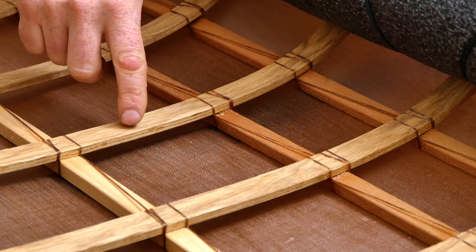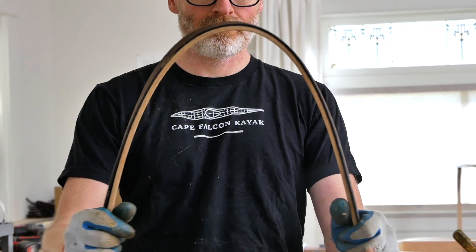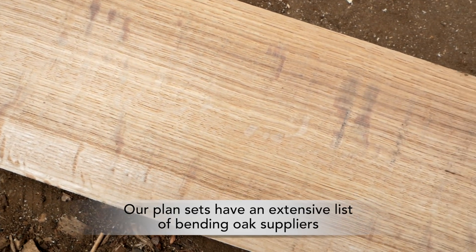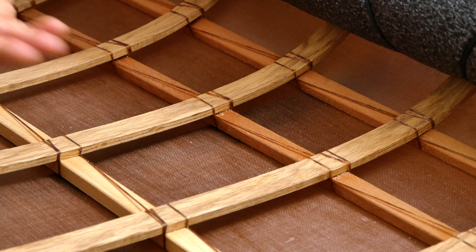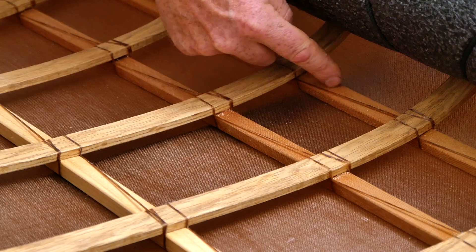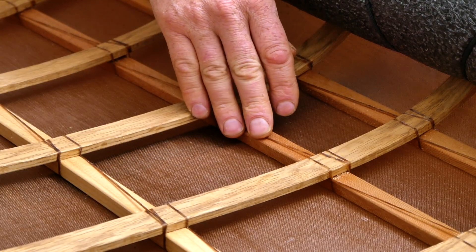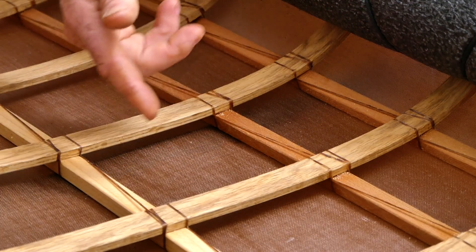As far as the actual wood the frame is built out of, I'm still using white oak for the ribs because it's strong, rot resistant, and steam bends really well. I would always recommend paying extra money to get really high quality bending oak because nothing is more frustrating than fighting bad bending stock. For the longitudinal members, I used Port Orford Cedar for the keel mostly because I had it sitting around and wanted it to be a little bit stronger, and then Red Cedar for the rest of the stringers and gunnels to keep the canoe nice and light. If you have a full selection of wood available, you can choose any long clear softwood with the strength-to-weight ratio you want.